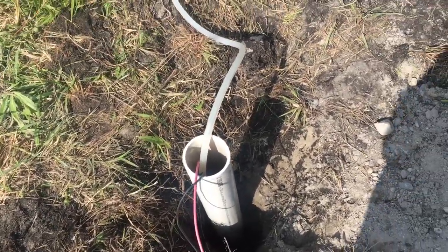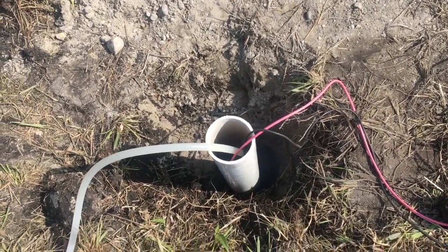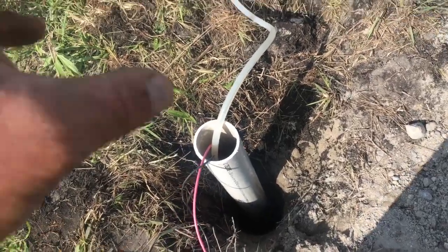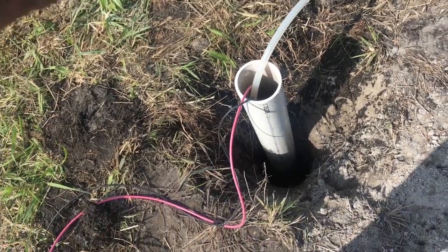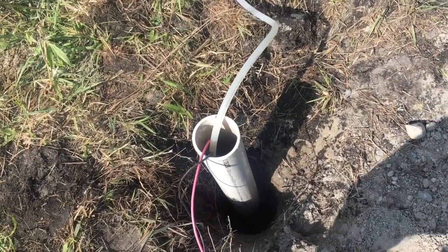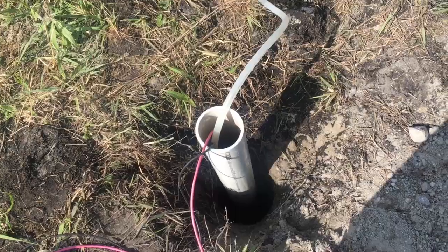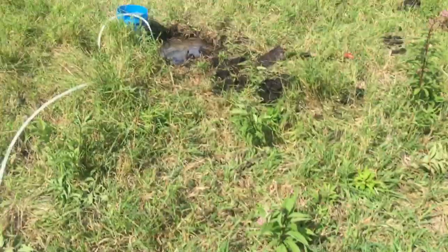As you can see I put the casing down there — four inch PVC casing. I cut some slits in it to let water in and then I put some filter cloth around it. I'm going to back fill this in. A buddy of mine who does well drilling said put it in with sand as a filter. I want to keep kind of an open cavity because it's such a shallow well, so I can keep up with groundwater recharge. I've got some stone I'm going to put in there. Here's my auger bit that I'm using.